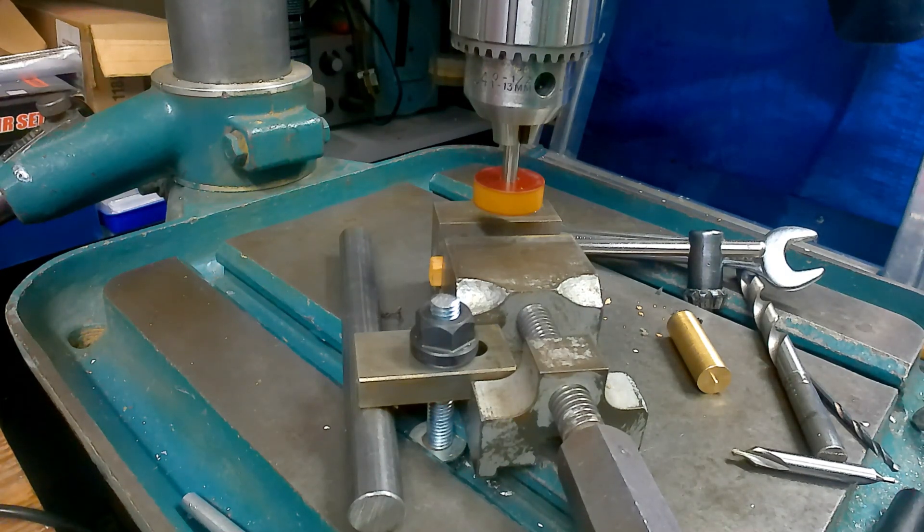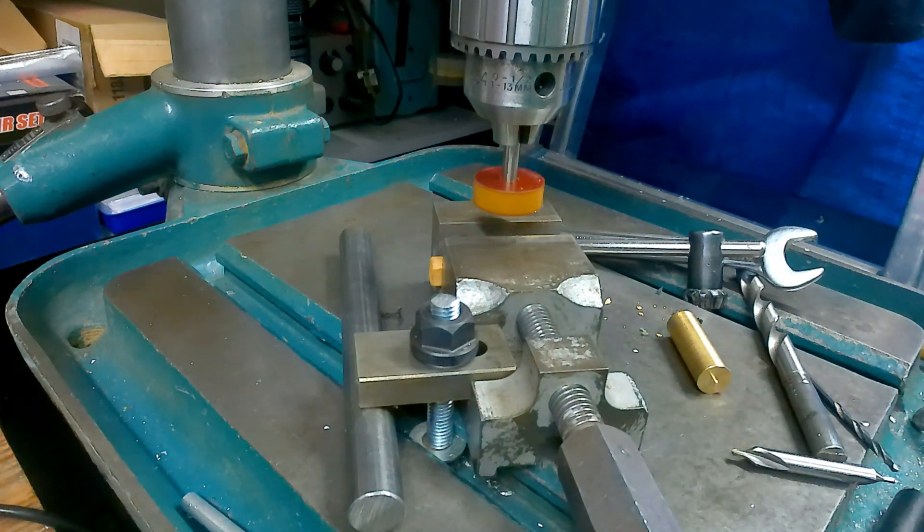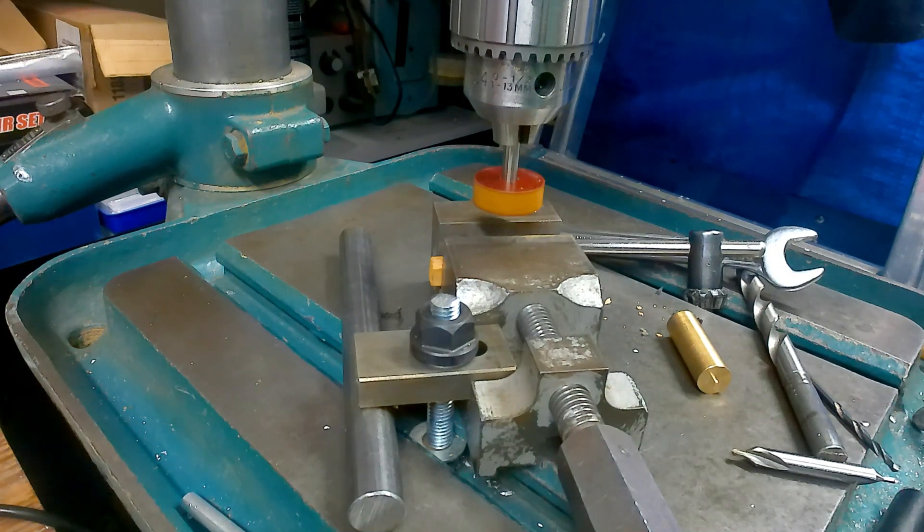I hope that gives you a little insight into a quick and easy method of turning out a decent job. You can still do it the old way - balance a rule on top of the part and slide it backwards and forwards until the rule comes level - but that's a bit hit-and-miss to me. If you want a decent job, put a little bit of time in it. Once you've made these gauges, keep them in a box - so next time you want to do three-quarter inch, as time goes by you'll get quite a collection of these little homemade spacers.